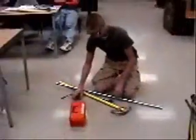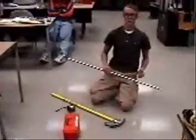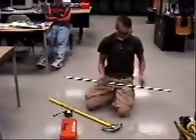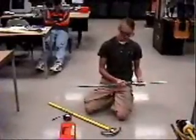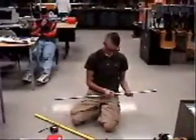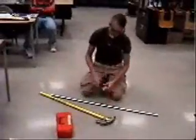And then we're going to do a 30 degree bend, so the multiplier is two. So you multiply four and a quarter by two, and that would be eight and a half. You make your first mark, and you want to go all the way around to eight and a half.